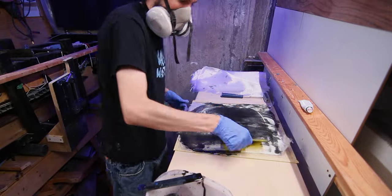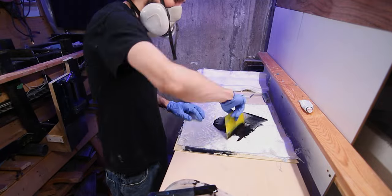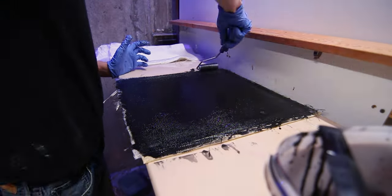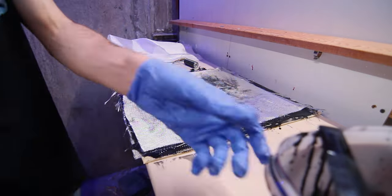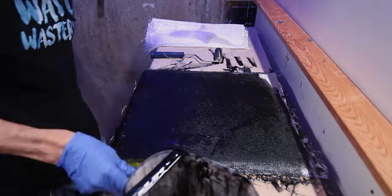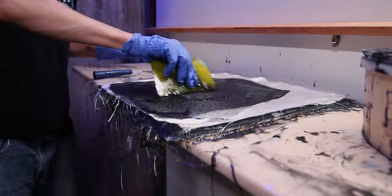One way to improve your resin panels is to use a resin roller, and these come in slotted and ringed, and what these do is they'll help push out any bubbles from your laminate. They're very often used by boat builders, and from the ones I've talked to, they tend to prefer the ringed because it'll pick up and throw less resin than the slotted. But this is definitely something you should use if you're going to lay up fiberglass panels.